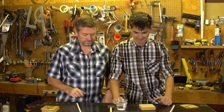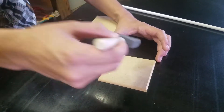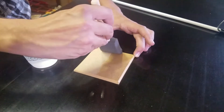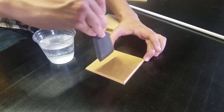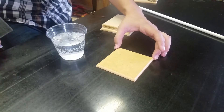What we're doing now is taking this water and baking soda mixture and just lightly painting it onto the top of the wood. The reason it's water and baking soda is the baking soda ionizes the water, allowing current to flow through it. You just want to do a little bit and let it absorb into the wood.